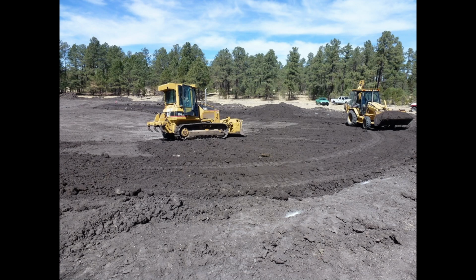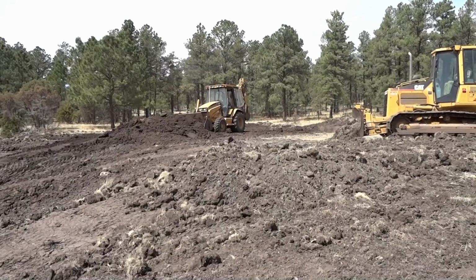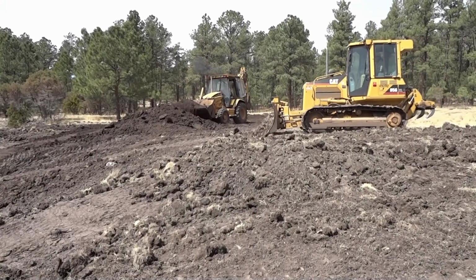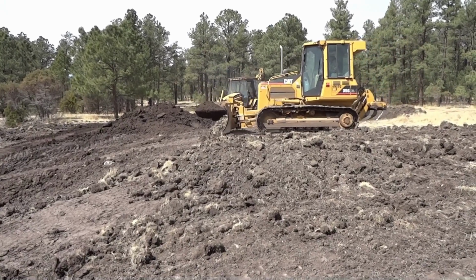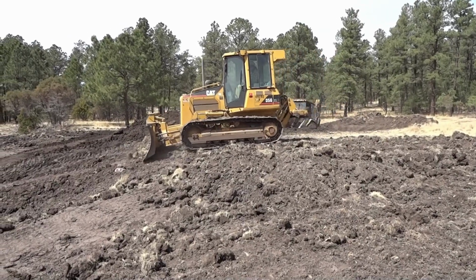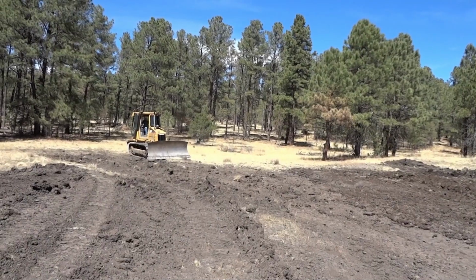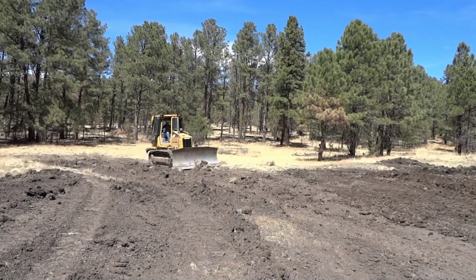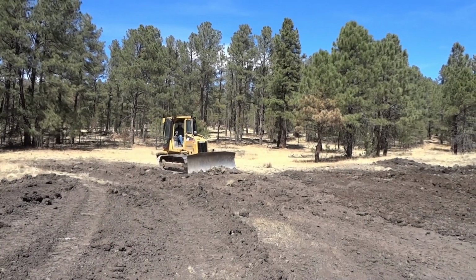We've almost finished lining the wetland basin with compacted clay that's at least 24 inches thick. There should be no piles of clay left over, providing the soil that was spread in the wetland has been compacted. The dozer begins spreading topsoil over an area of compacted clay while the backhoe operator continues to place and compact clay soil in the basin. Notice how the compacted clay is smooth while the spread topsoil is rough. It doesn't take long for the dozer to spread topsoil that was saved. The dozer excels at pushing and spreading soil distances less than 300 feet.